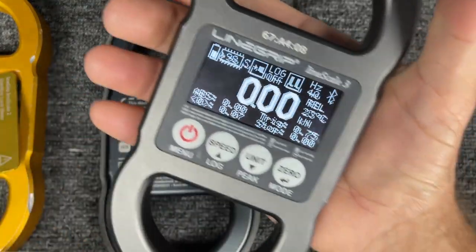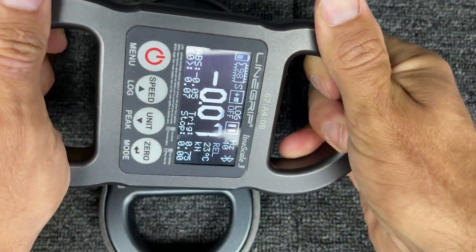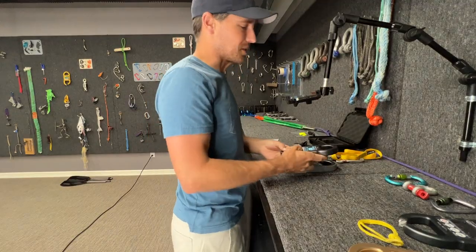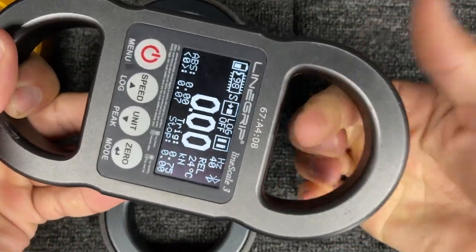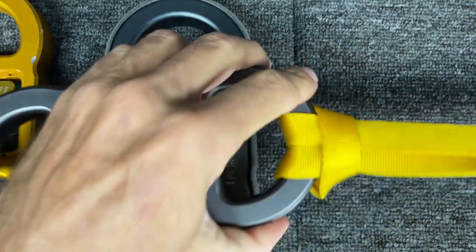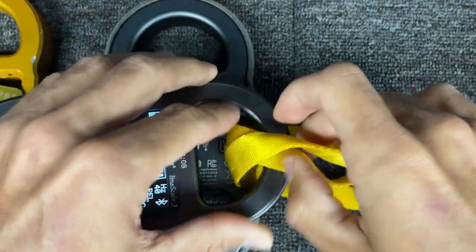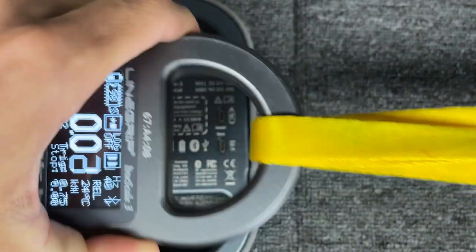However, if you squeeze it sideways, it's obviously torquing it differently. If you bend it a certain way you can bend it to 0.2 kilonewtons. So it's important to understand how they've told this machine what is what, because pulling it with your whole hand will pull differently than with just your finger. If you were to take a sling and girth hitch it, it's not pulling evenly on this and can give a slightly false reading. If you use a sling, do it in a basket shape which pulls more evenly. The more I've respected how I pull on this, the more accurate the numbers are.